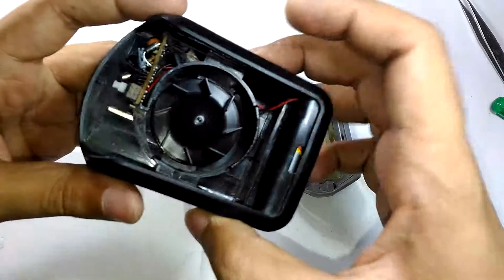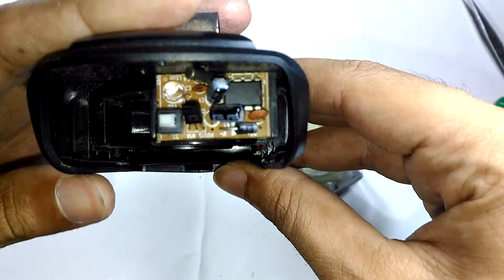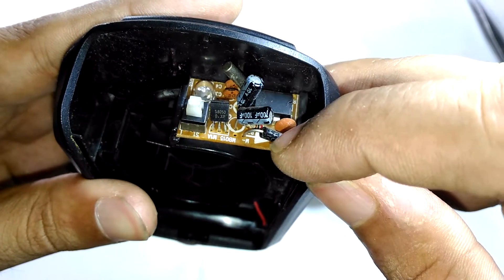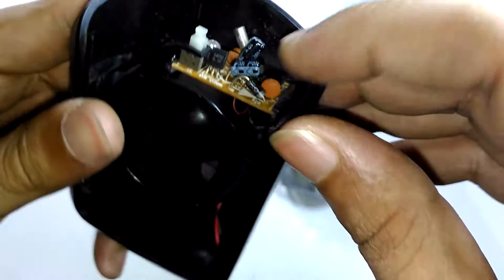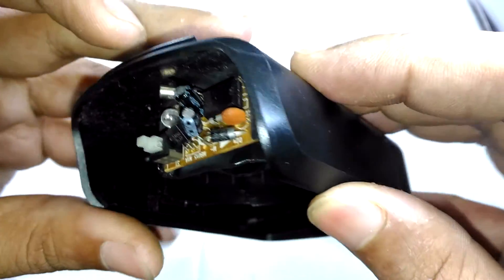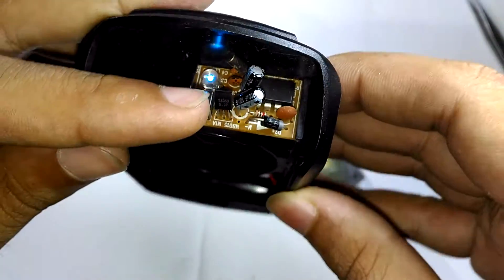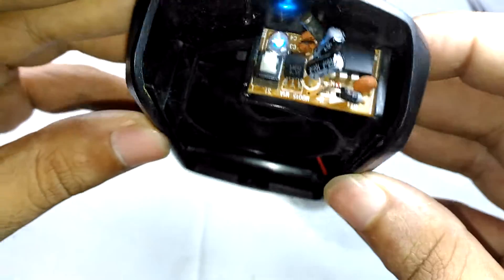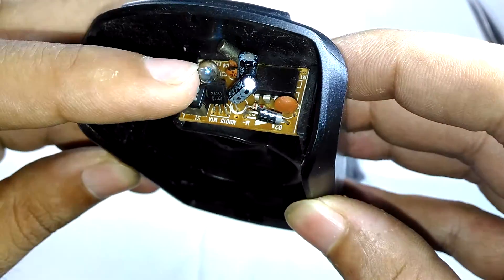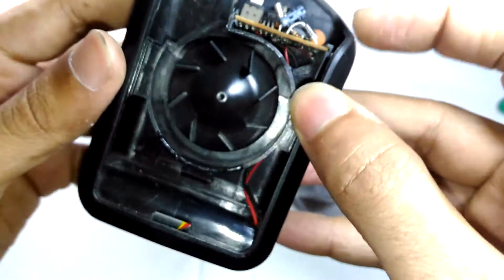Let's take a look at the components. It has a crystal, a few capacitors — 100 microfarad, probably generic ones with no branding visible — and the LED right there with a very faint glow, probably because the battery is going dead. There's also an S8050 transistor, which is the switching side.